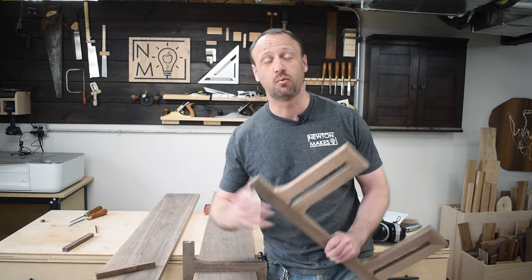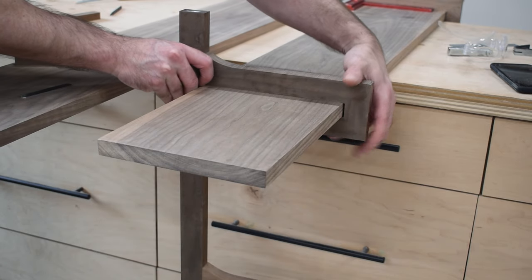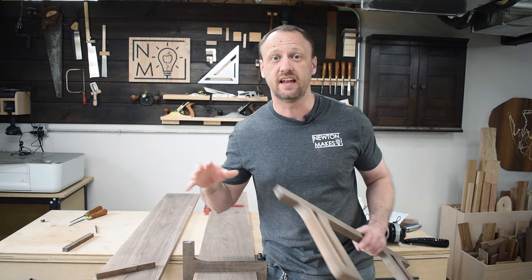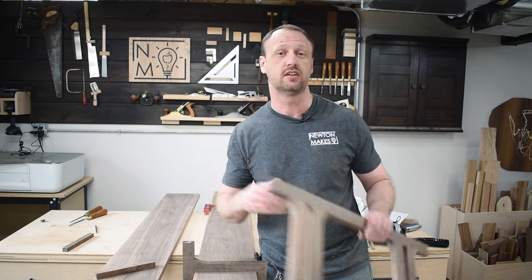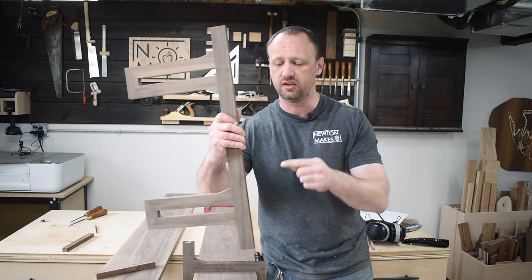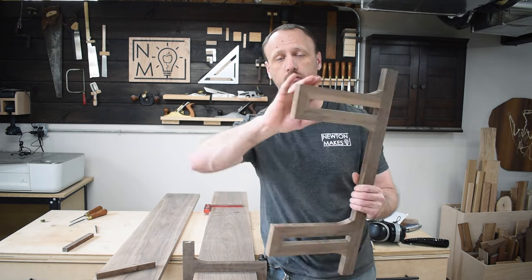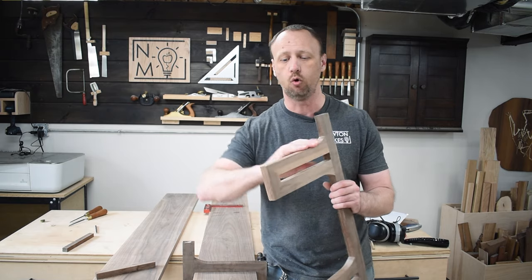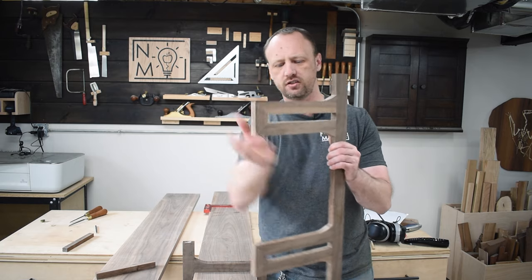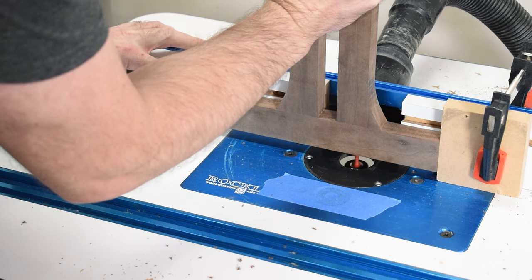The shelves look great. The brackets slide on them nicely, and I made sure the shelf boards are slightly narrower than the slot openings for my brackets — that way I've got a little extra room for expansion and contraction. Now I can focus back on the brackets. First, I want to put keyhole slots in the back — two in each bracket — that's what's going to hold them onto the wall. I also want to do a significant round-over over the whole thing. I want everything to be super soft, almost pillowy, so all these surfaces are going to get rounded over at the router table.